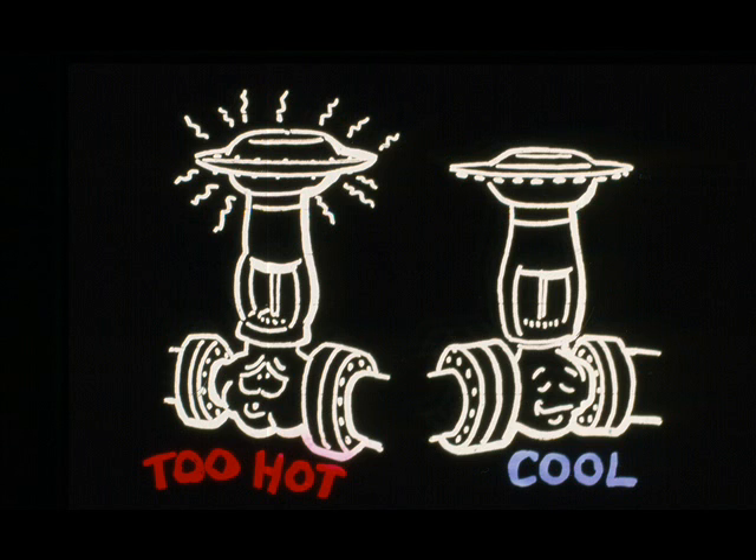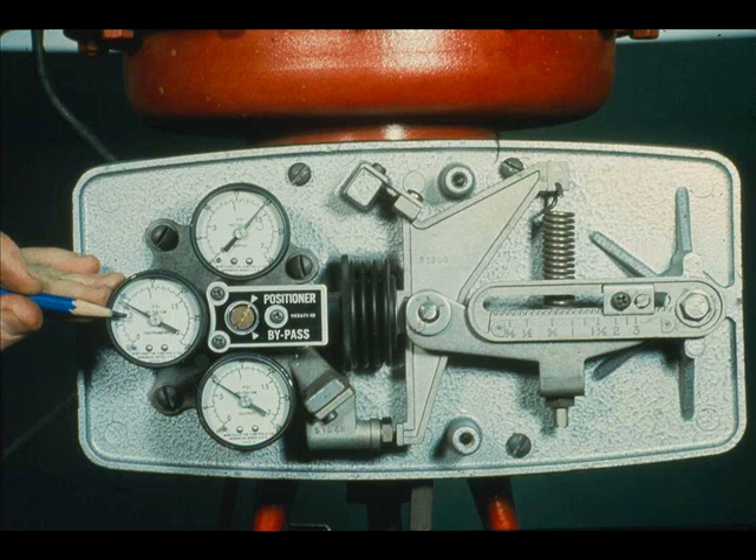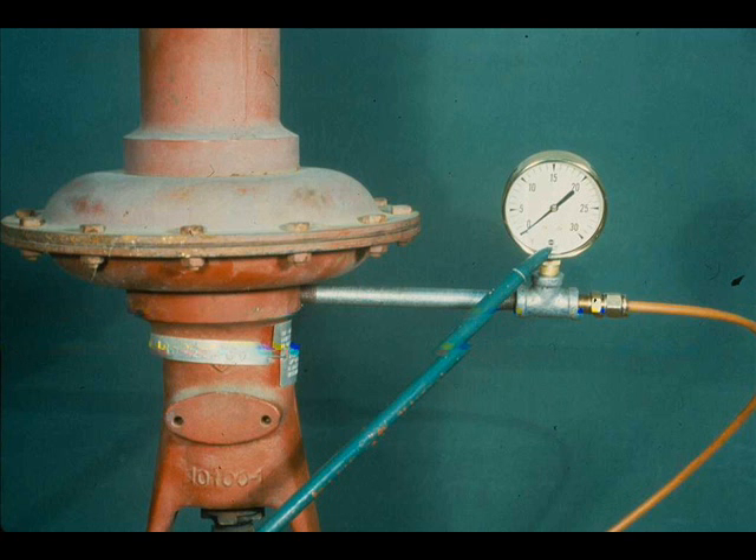A final item about inspection: check the overall environment. All actuators contain rubber in diaphragms or relays and cannot tolerate temperatures above 180 degrees Fahrenheit. This limitation implies that you should not mount an actuator inside or near a very hot process vessel or line. Be certain that signal tubing and air supply piping is adequately braced and supported. See if the control valve has an instrument signal gauge — the gauge can be in a positioner or it can be external.